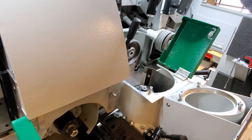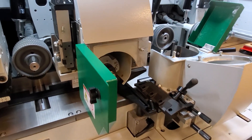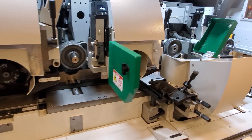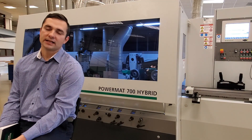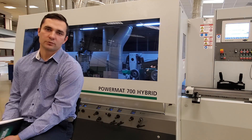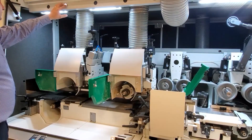For the spindles, we have two variations: inch and a half spindles or inch and 13/16 spindles. We're using the spindles on the first bottom, the first top, and the second bottom spindle. Powelock tool holders are used on the right head, the left head, and the second top head.